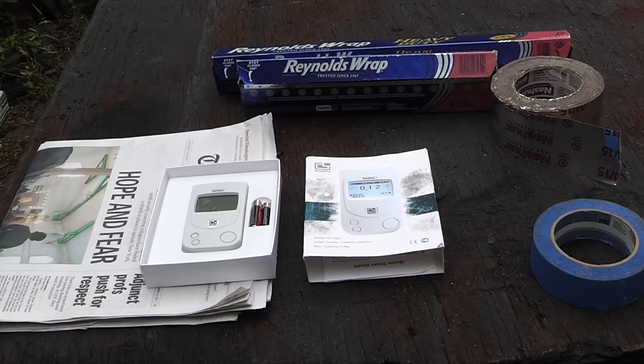I did have one comment where a guy said he didn't think it would work. What I'm doing may not work without some sophisticated test equipment. When you start doing a little research into EMPs, you find out that a nuclear-generated EMP can throw out about 50,000 volts per meter, which translates into about 6.6 million watts of energy per square meter. That's quite a bit of energy for a little area. The magnetic component can go right through materials.